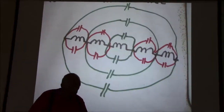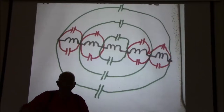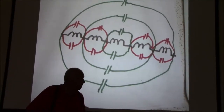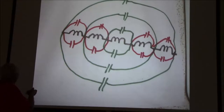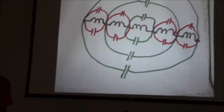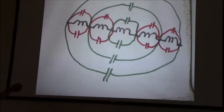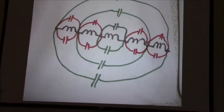So now we're going to go back and just look at the wire as a circuit element. It's a complete electronic circuit all by itself. The wire has inductance, and I can draw the wire as a series of coils, just like the little coil here. I've got a whole bunch of them, and they're all in series. Here's one, here's one, here's one, here's one, here's one, here's one. That's the length of the wire, and it has inductance like a whole series of little coils.